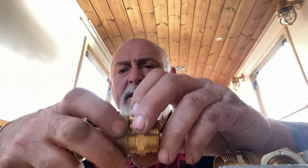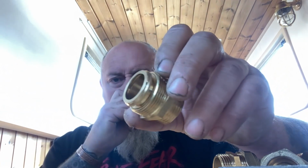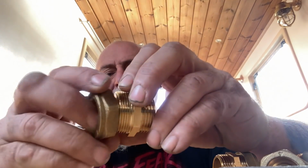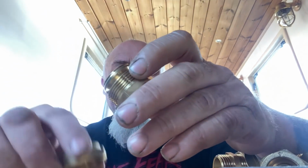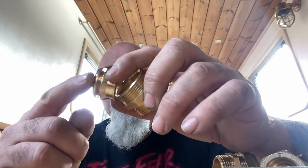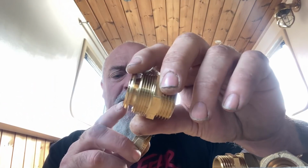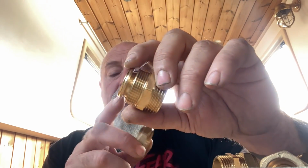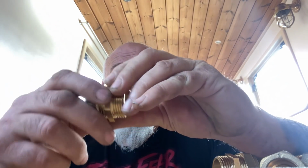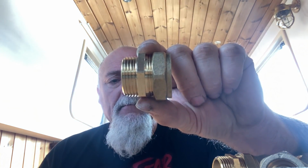Now what they've said is, let me pop you down, because I hadn't seen these before. Not very soft landing, sorry about that. So the way these work, you throw that way, and these actually fit inside and replace the olive, and then you tighten down, and that gives you your 22mm output. Now what they say about these is you have to tighten these up really super duper tight, and to a point where they crack. So I think this collar must break as you squeeze it up. So what I don't know is if that's a one-time thing or not. But anyway, I'm not going to tighten that up just yet. But basically, that gives me my 22mm out to 1-inch BSP tapered, which is in the stove.